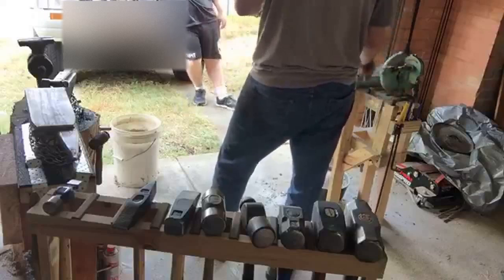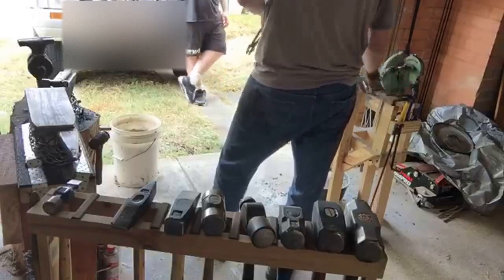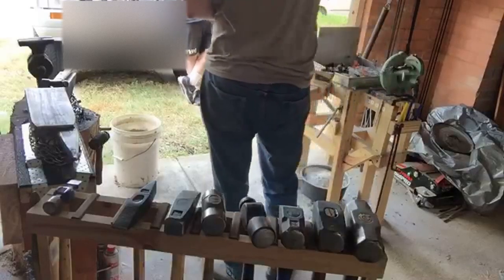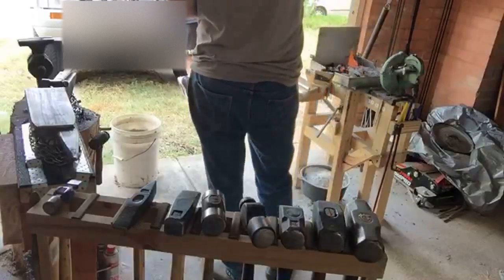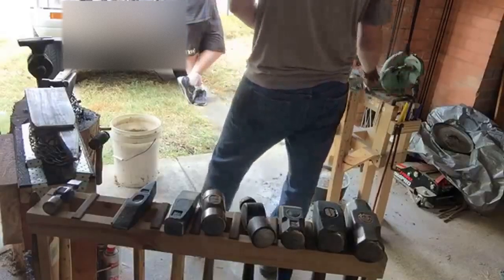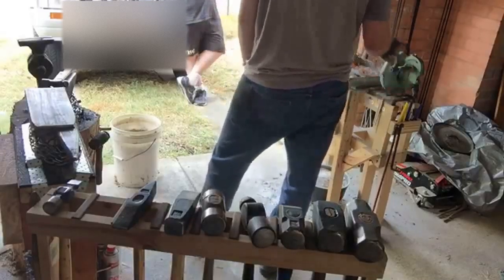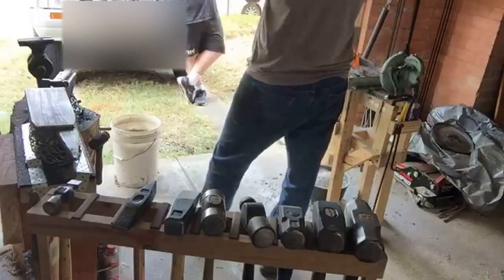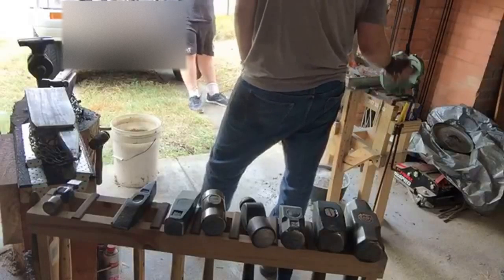Got a future project to build a new set of tongs that's parallel jaw flat part tongs. If you normally just have flat tongs, they open like that, so it's never parallel, and basically you can design them for one thickness of stock. Otherwise you just grip it with the front and the back of the thing. So I want tongs which actually will open and close parallel. That way I can use any thickness stock.